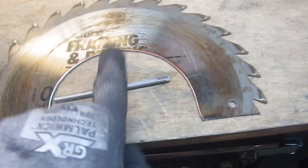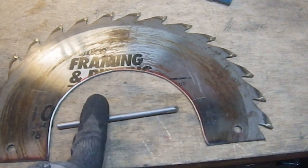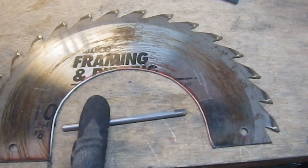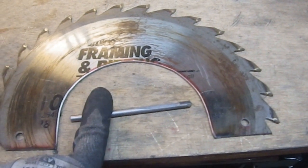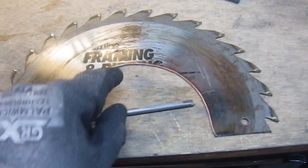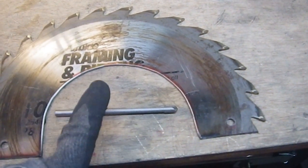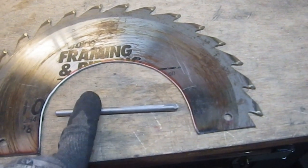So yeah, get yourself at least a couple of these, folks, and you're going to want to drill at a low RPM. I recommend using some kind of a guide if you have a hand drill. If you don't, preferably a drill press of some kind. But if you don't, if you have one of those guides that'll help you get a square hole in something, definitely use the lowest RPM that you can get away with, because this thing needs that.